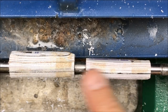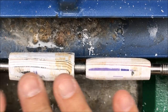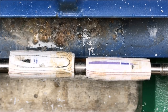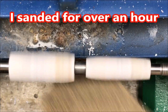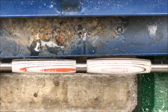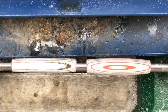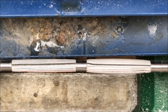I went back over to the belt sander and took the harsh edges off, and I'm going to go after this with my 40 grit. If I can get it to start shaping a little bit, then I can drop to 60, 80, and so on. I think I'm just going to end up working this down with sandpaper to see if I can make it work. I did a lot of sanding to get it shaped like this. I'm at the point now where I'm going to use a little micro mesh and try to wet sand it to take some of the scratches out and polish it up, in hopes that I can then put a CA finish on it.